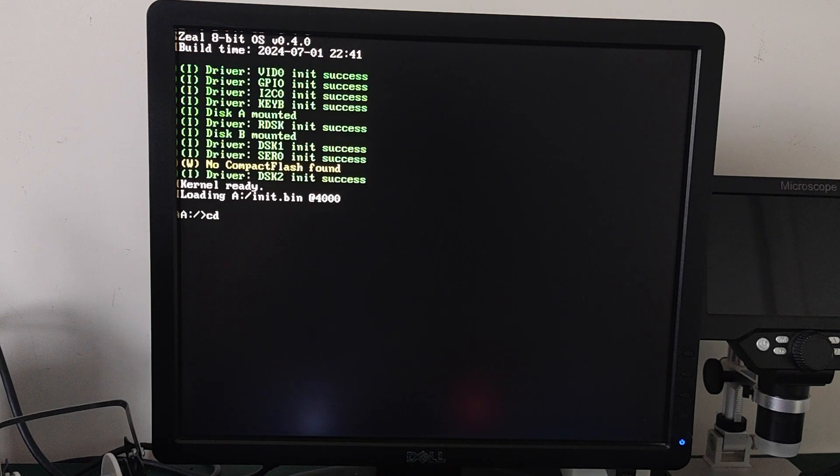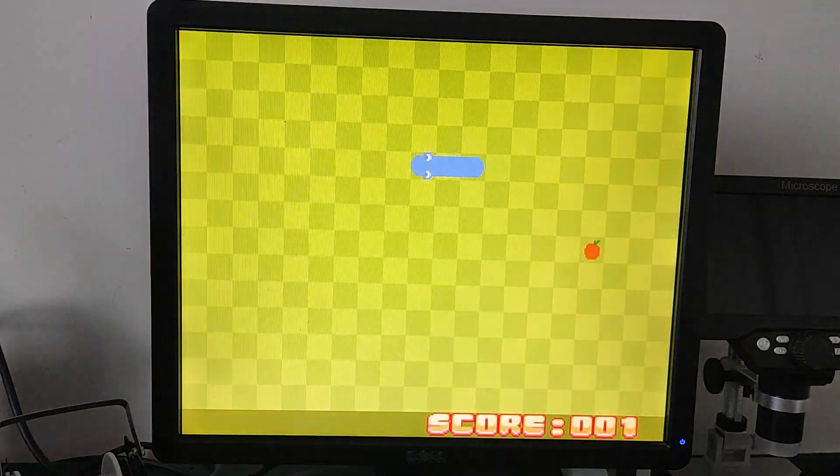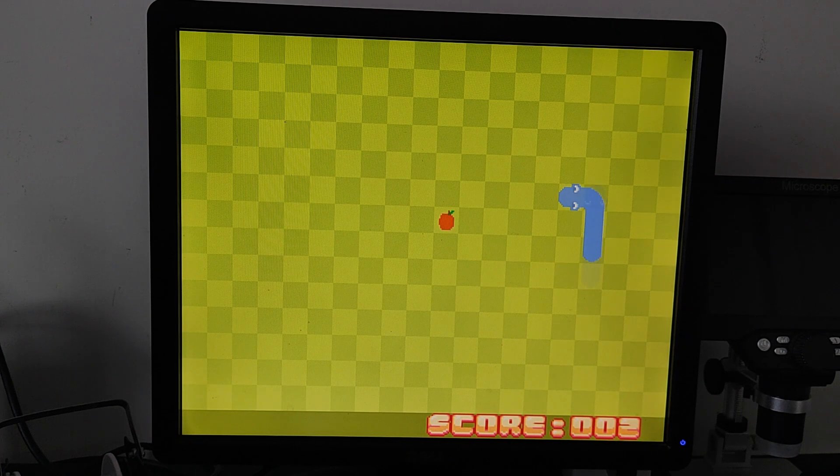The RTC is disabled because I didn't put any battery in it. I press one to boot into the OS. I can CD to the EEPROM disk, which is empty of course. I can create a directory inside just to test it — everything looks fine. I finally try to execute the snake game, which uses the graphics capabilities of the video board — and yes, it works too. This means you have perfectly soldered the board and you can now start working on your Zeal 8-bit computer. That's it for this video — I hope it helped. If you have any suggestions or are encountering any issues, feel free to leave a comment below.